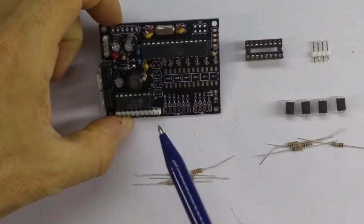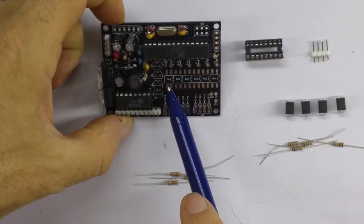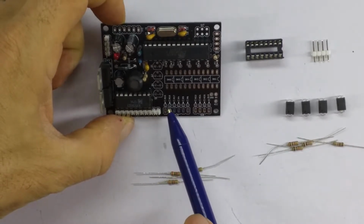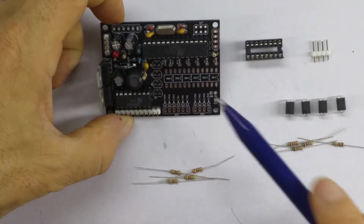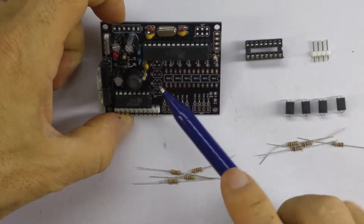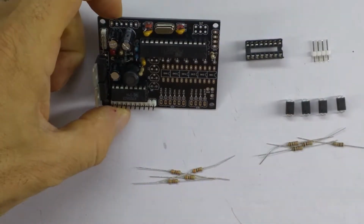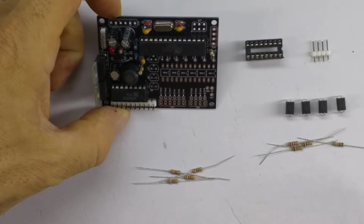And what we're going to do, this is quite important to notice, we're not going to populate Opto Isolator 5 or 6, R15 or R16 or R12 or R13. So those are all going to remain unpopulated. Normally they would be there for the extra 2 anodes, but in this case they've been reused and they're brought out to this header up here so that we can have an extra GPIO, for example for managing chimes or something, and a PIR input.